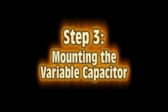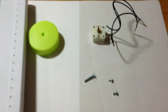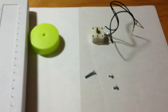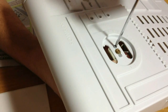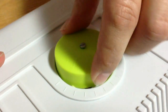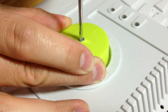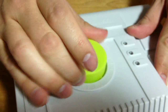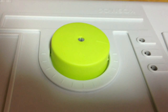Step 3: Mounting the variable capacitor. You will need the upper part of the console with contact clips, three screws from the bag of small parts, the variable capacitor, and the rotary knob for the variable capacitor. The variable capacitor is fastened to the upper part of the console using the two short screws. Its terminal leads point backward, meaning toward the contact clips. Then the rotary knob is stuck onto the axle of the variable capacitor and the axis is carefully rotated until it stops. The marking on the button — the short line — also needs to point to the left. Now screw the knob onto the variable capacitor using the long screw.